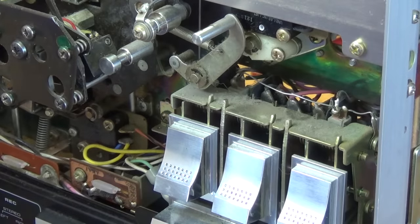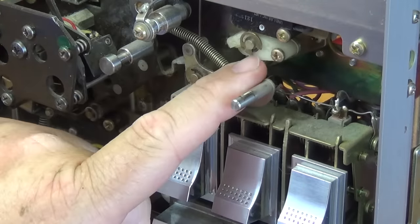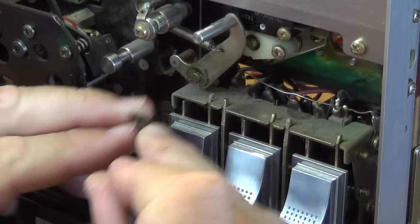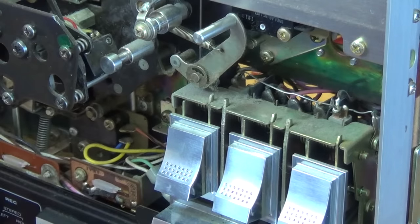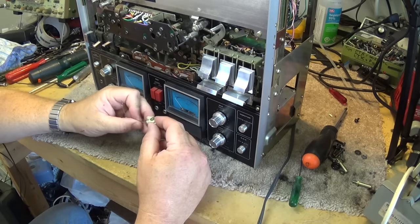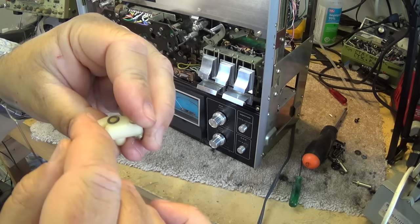Now I've got it. I have to glue it back in place, and then I can get this machine working. I have to remove this little c-clip so that I can take this arm off to reattach it. It didn't even break — it just came off. It goes in place like this. I don't know what holds it in place — I think a piece of plastic may have broken, or there might have been a pin. There was probably a little piece of plastic on the front here that broke.